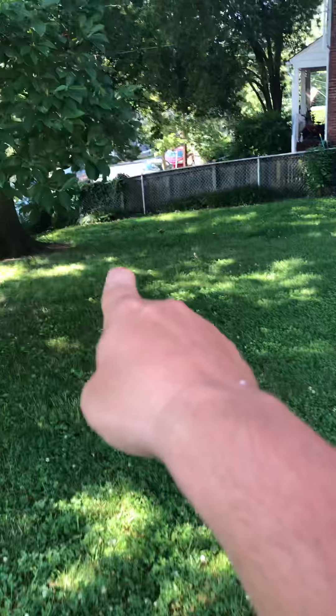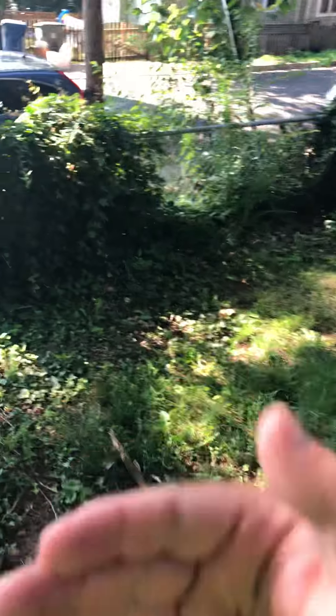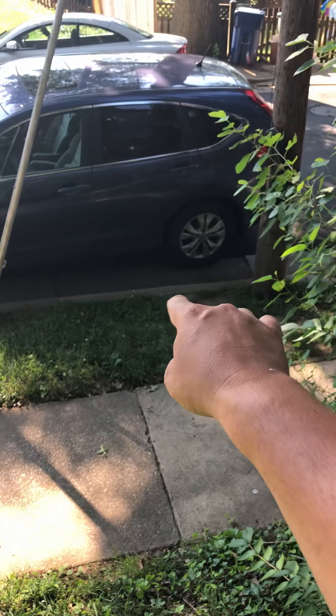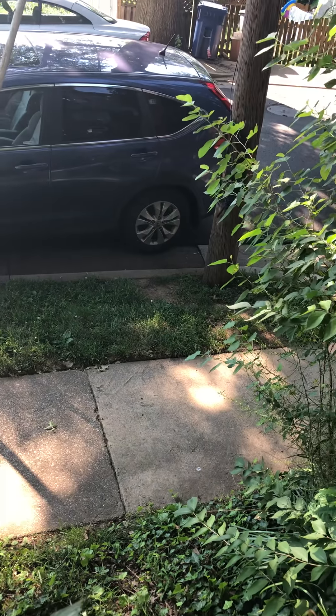Daylighting — as you know, there's a four-inch clay over here that's currently being utilized for something, we don't know what. You've asked us to upgrade it to six-inch. I can't have that line dumping on the side of the hill just before the sidewalk, because that will cause a huge liability for the sidewalk. We have to get this line to the curb. And you've seen that we have a curb — a four-inch line right there. Bringing a six-inch down to four-inch, that's questionable.